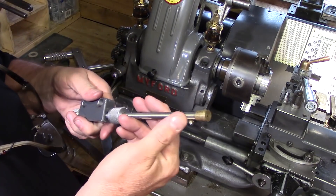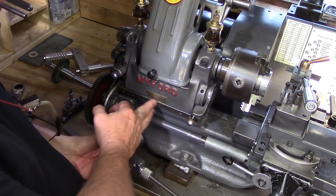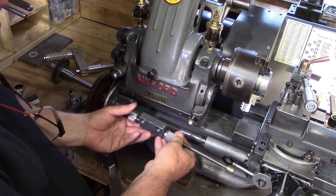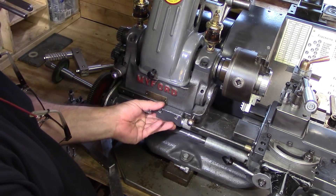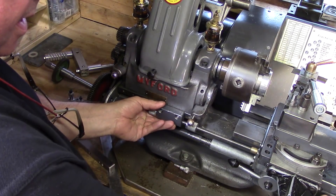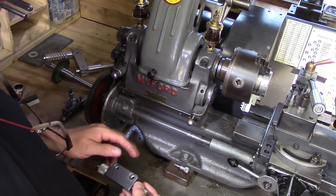There's a little brass stop end there, and what I did was I drilled and tapped this flat part of the lathe — which is like a continuation from the main bed that obviously supports the headstock — and I drilled and tapped two M5 threads in there. That simply bolts on and as you can see then acts as a stop which you can adjust using these screws, and it just comes up against the carriage. That was the first mod I did, and I never really liked having to tap holes in this.